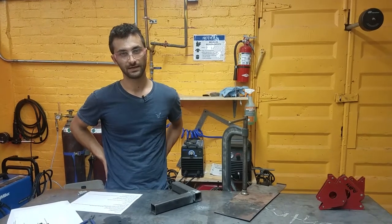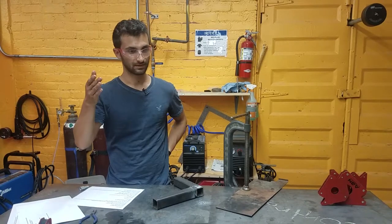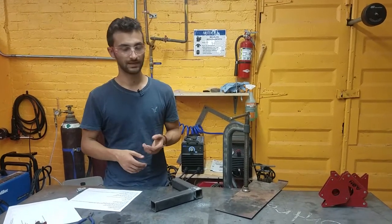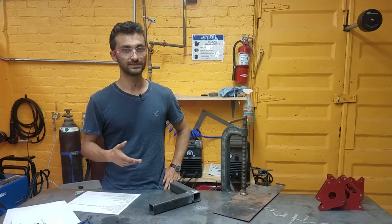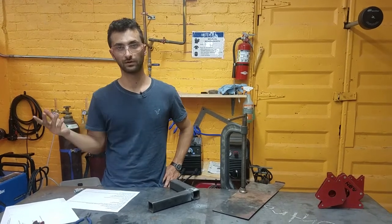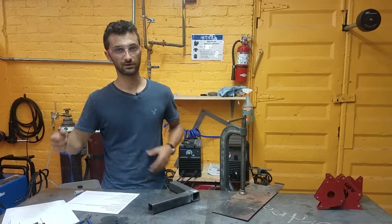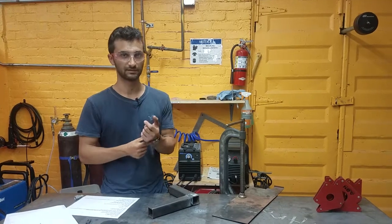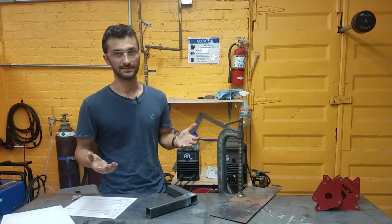The one that we have can do a severance cut up to three quarters of an inch — that means it can take a piece of metal and cut it into two parts. It won't be pretty, but it'll get all the way through. It can do a nice cut up to probably half an inch, which is pretty impressive. Probably the only time you'd want to use the plasma cutter over the water jet is if it was a weird shape that couldn't fit in the water jet, or you like the idea of a more organic, natural shape done by hand versus the strict vector lines of the water jet. But there are certainly scenarios.